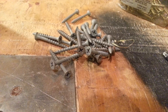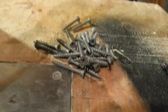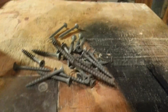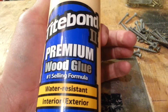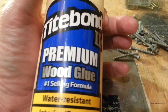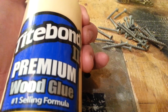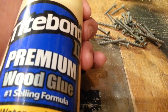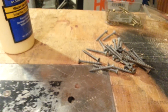You've got a few choices when it comes to assembling your boxes. What I like best is screws — exterior deck screws. If I'm going to do a natural finish like linseed oil, I'll use golden screws because they blend better with the wood. When I'm painting, I use regular gray or green exterior screws. Then a good quality glue — ultimately the glue is what's going to hold it together, so the screws are basically there to hold it until the glue dries. I've put them together with eight-penny nails and they did just fine, and you can also use a crown stapler with sizable staples. The only reason I do it this way now is I tend to sell a few every year and this looks a little better.